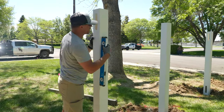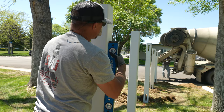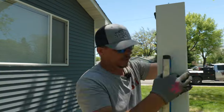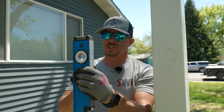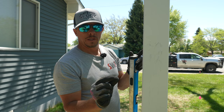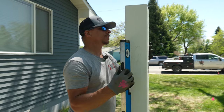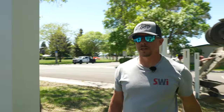We use this same method for chain link — it doesn't matter if it's chain link, a wood post, or one of our postmaster posts. You'll find it doesn't take much to move a post over a quarter inch or half inch. One thing we see our guys struggle with most is striving for absolute perfection — a bubble precisely between the two lines. That's great if you can get it, but if it's a fraction off, from top to bottom it might only be out of plumb that much — and you're never going to see that. With that set I can verify we're still lining up, which we are, so this line's set and I didn't use a string anywhere.